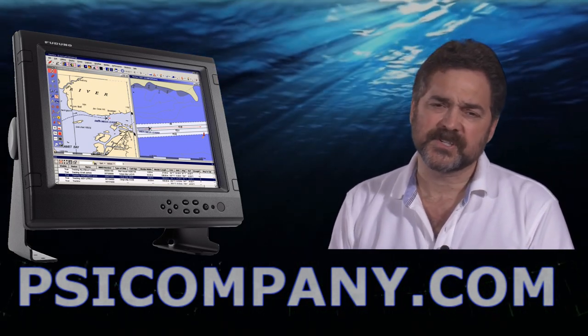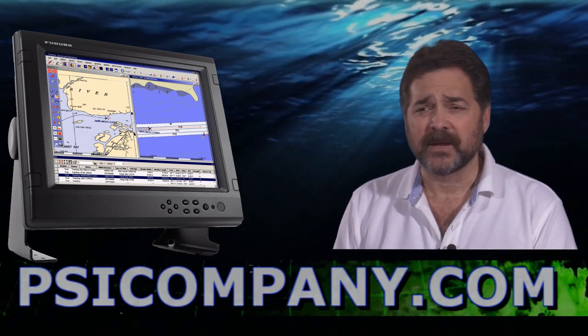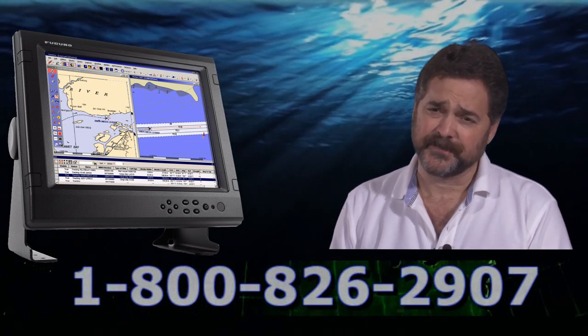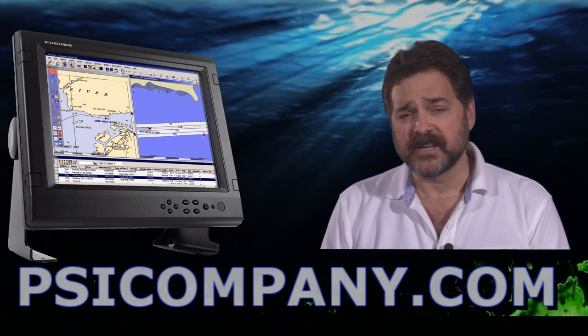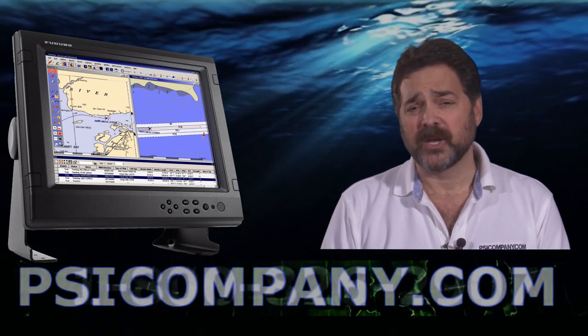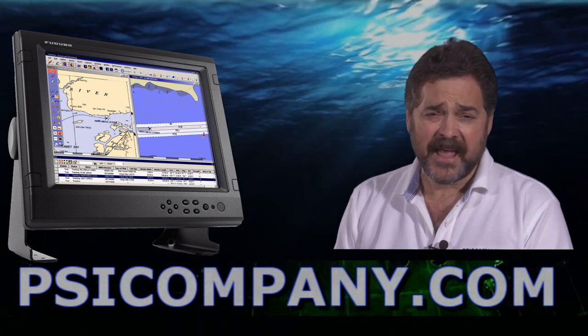A couple of the key characteristics about the Furuno MU-155C: it is built to the SVGA standard which is 800 by 600 pixels. It has a built-in scaler which allows it to scale to 1280 by 1024 pixels, and that's the equivalent of the SXGA standard. It also includes two RGB analog inputs directly into the monitor and one DVI digital video input as well. There are also three NTSC or PAL video inputs that can be directly controlled by the Furuno MU-155C, and these can all be ported directly to picture-in-picture functionality as well.